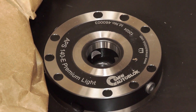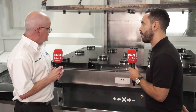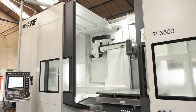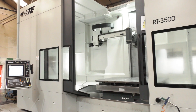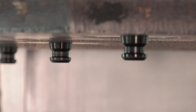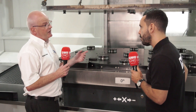These pots repeat to better than five microns every time, so setup time is virtually gone. This was designed for Oxford Engineering — they came to us with an idea and specification and we worked with them to develop it. We then inserted our standard APS modules into the plate and cross-drilled it all up to link it together. The two measurements you take with these are the holding force, which is 75 kilonewtons, and then there's the pulldown force.